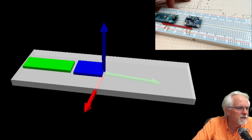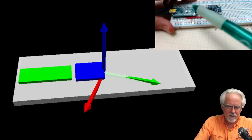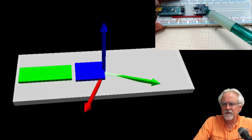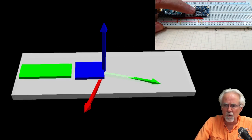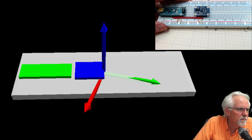Someone asks when the PID motor control tutorial is coming. The challenge is you need a motor, transistor control, and a way to measure speed — like a slotted wheel with an optical encoder. Counting beam interruptions tells you RPM. The hardest part is measuring speed accurately. With different motors, transistors, and the need to 3D print a disc and motor holder, you're talking about $100 of stuff and 3D printer access — I'm afraid only about 10 people would actually follow along.